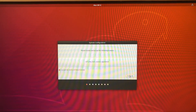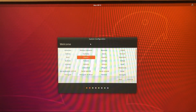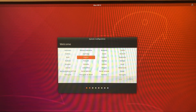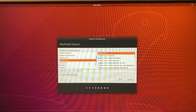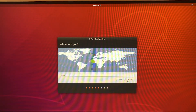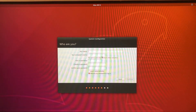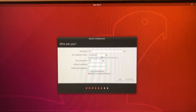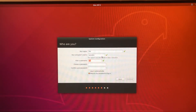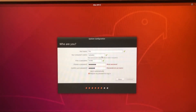After the flash process, on the screen connected to the Lita, we will have the Ubuntu system configuration. Follow the instructions to select the language of the system, the keyboard layout — this is the standard method to configure the Jetson board. In our case today, I select Lita, the name of our carrier board. This Nano is a Nano developer version. Select the computer name that you prefer. Indicate the app partition size you want.